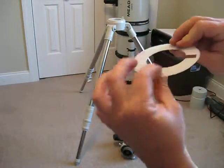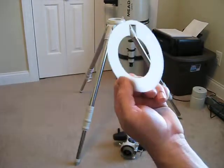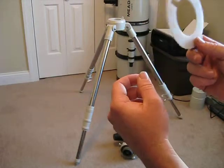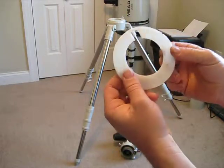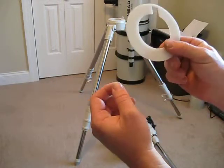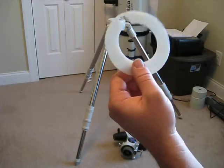The nylon is really nice and smooth — it'll move freely and also act as a shock absorber, as will the other nylon washer on the bottom. I got this from work; I'm not sure where else you could find one of these. It's basically a wear shim we put in between a backhoe bucket and the stick on a backhoe loader — it's got about a two-and-a-half inch pin diameter. I didn't get a part number, but if you want one, I can probably get you a part number and you can go to your local CAT dealership and pick one up. That's going to be the only thing that's really tough to find for you guys.